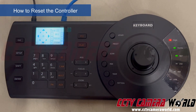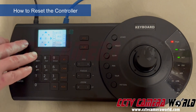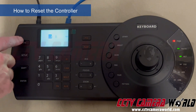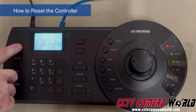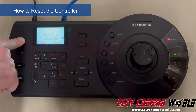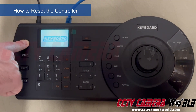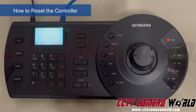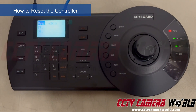Last but not least, if you lock yourself out of the PTZ controller or aren't sure what password was set, you can easily reset it. From the menu — if you're in an NVR or DVR, hit the ID button first to return to the ID page, then hit Escape until you're back at the date and time screen. To reset, press and hold the Escape button for 15 to 20 seconds. The controller will reboot and return to the initialization page from the beginning of this video, where you hit Enter and re-initialize the controller.